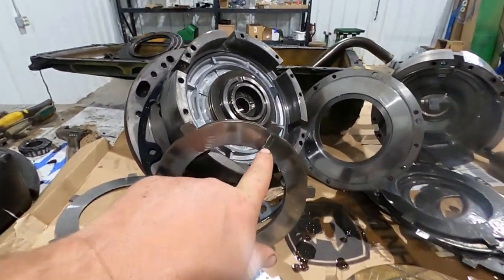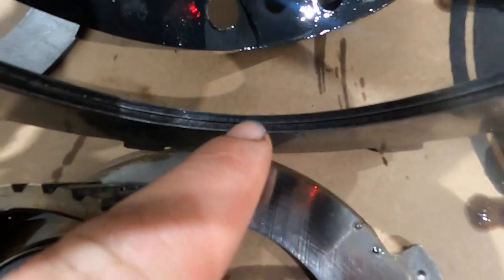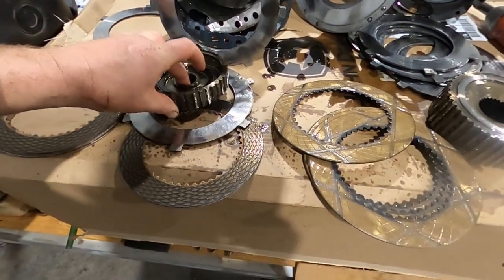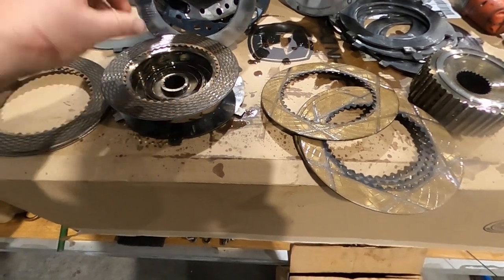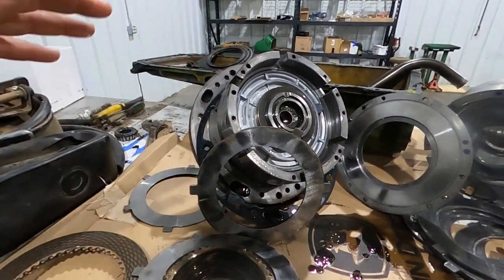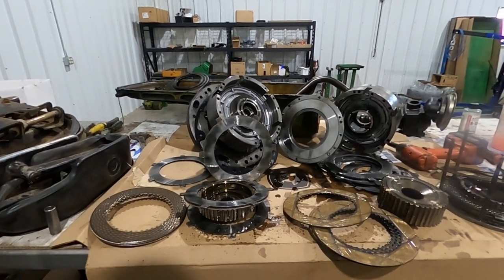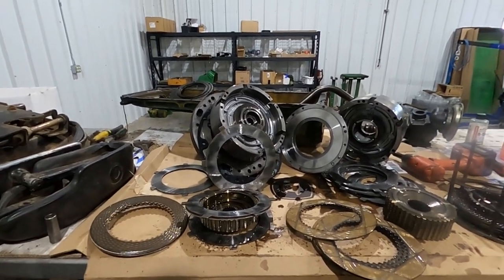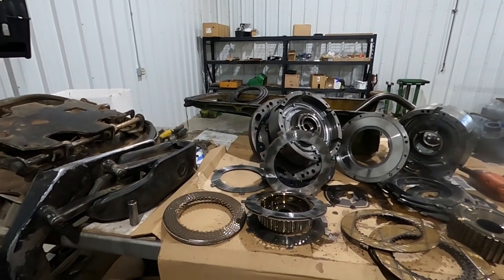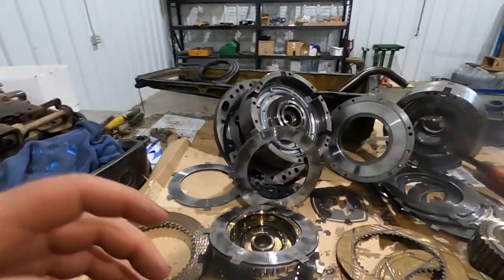You can see these polish marks. The plates are kind of warped a little bit — you can see down here that the plates are tight together, and up here there's a good gap. If you got that whole stack sitting on this gear, that little bit of warpage adds up across the plates, and that will cause that clutch pack to drag. That makes for poor shifting — a little bit of jerkiness or drag between shifts and can cause a little loss of feel on the clutch pedal.